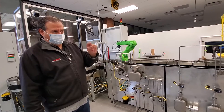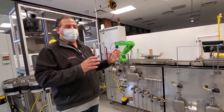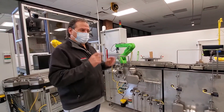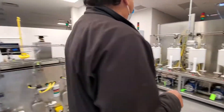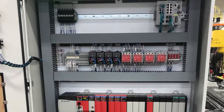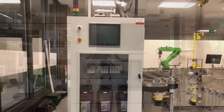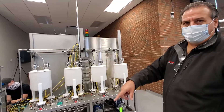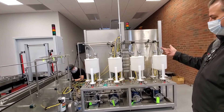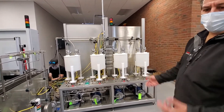These actually measure mass — we're measuring things as small as drops. It's very hard to do what we're doing here, and to get the precision level we want, analytical models will have to be built to achieve repeatability and precision. The transmitters are over here on the panel. This is the other part of the liquid skid — we've got pumps for four components: a combination of water, red, yellow, and blue dyes. We have high and low level switches on load cells for inventory management, and we can do loss-in-weight comparisons with actual flow. Positive displacement pumps move the fluid, and pressure is controlled either through automatic pump speed control or through traditional mechanical pressure regulators.